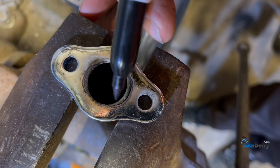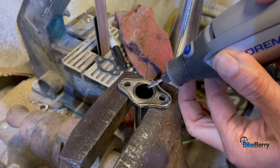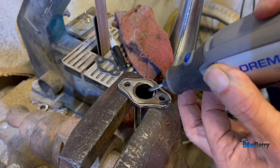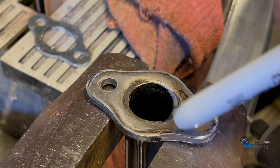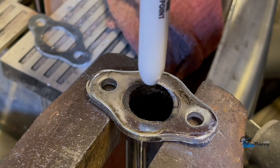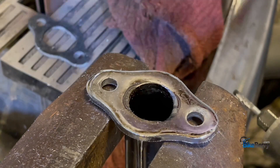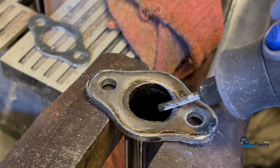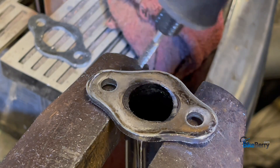Okay, we are going to use the black marker this time because we have so much excess metal to take out. You can see the lines there and there. Now, if you notice, I went at an angle with the bit — what I did is I traced where the black lines were so that I had a hard edge to work towards. Instead of going straight in, angle it, trace out the black lines, and then you know exactly where to cut away. The black lines are going to get removed anyway and get dirty, so they disappear kind of fast. The other reason I did the angle is because if I'm straight up and down with that much material, the bit has a chance to zip around and get all crazy — so I'm trying to keep it from being crazy.